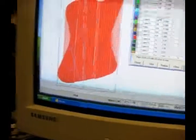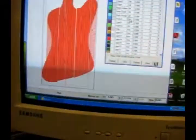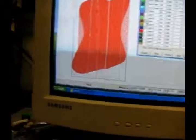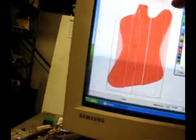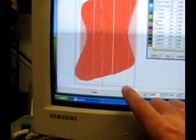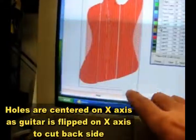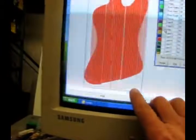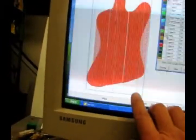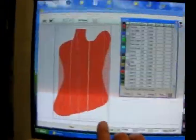There's that pocket right there. Once I imported everything in here I could see where to drill the holes to hold the board down — they're on the brown layer. I drill those through the blank and then move the blank and drill them through the table, and I bolt the blank to the table.